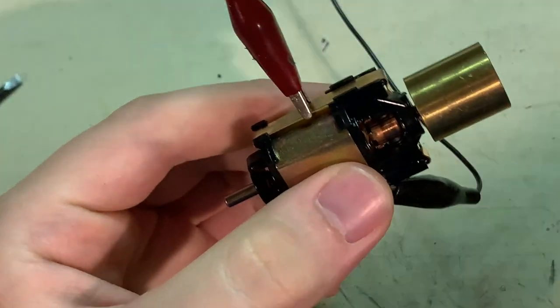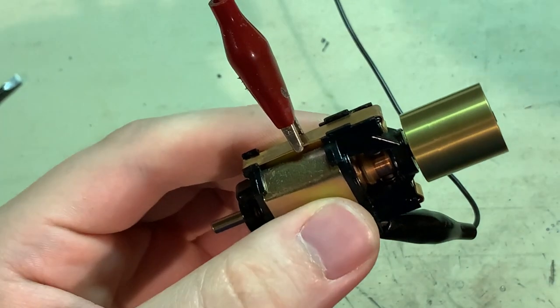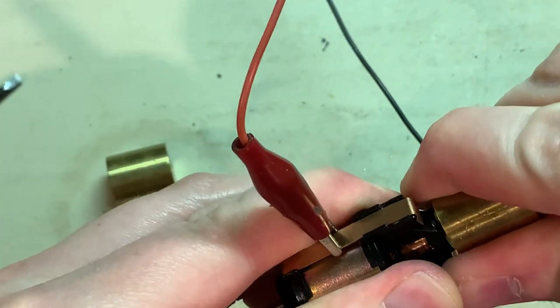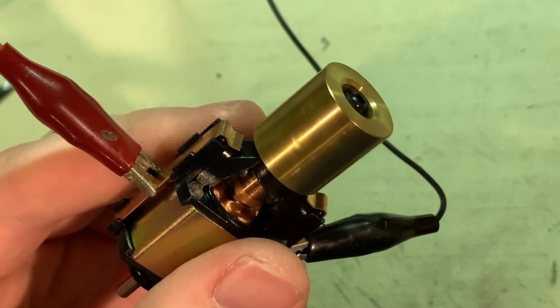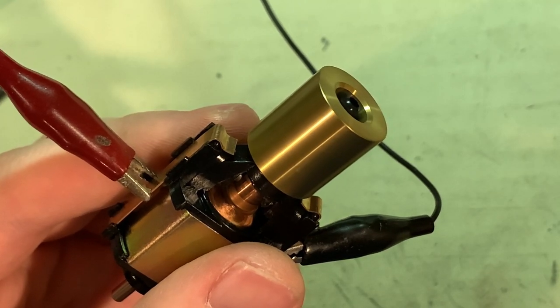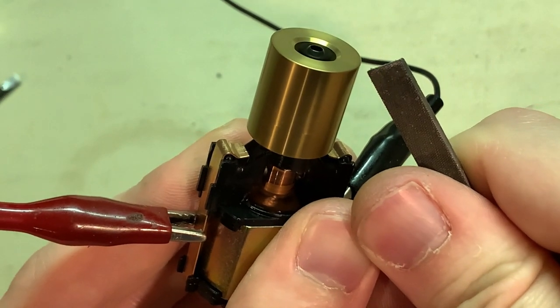Test one at a time — I feel a little vibration in this one but not much. It's usually hard to see the exact point where a flywheel is off balance, so an easy way to find that is to make a marking in it while it's running. I'll use the edge of a file here, then check a few different spots. I can see the middle point of imbalance is right about here.